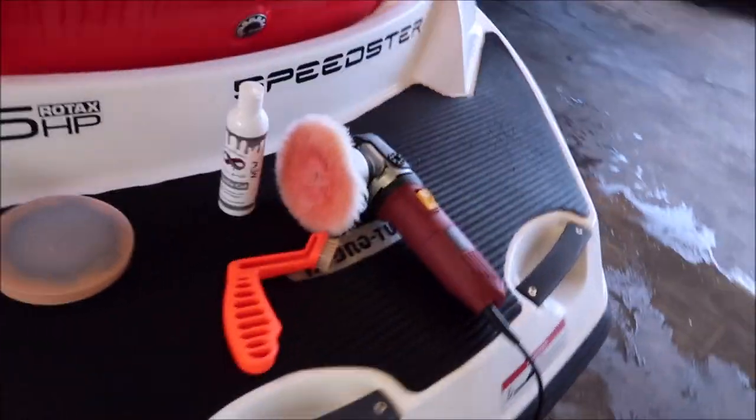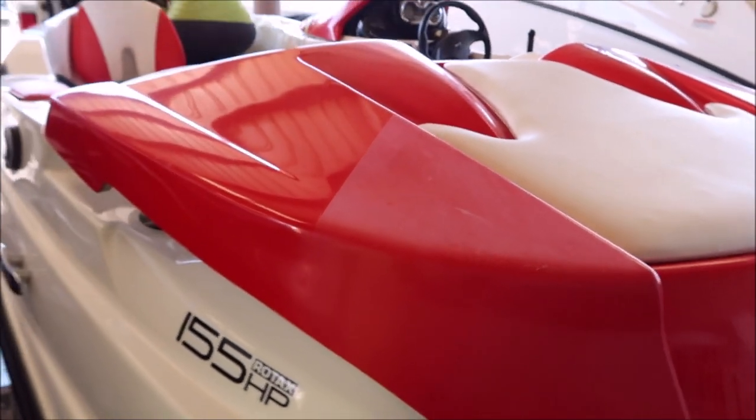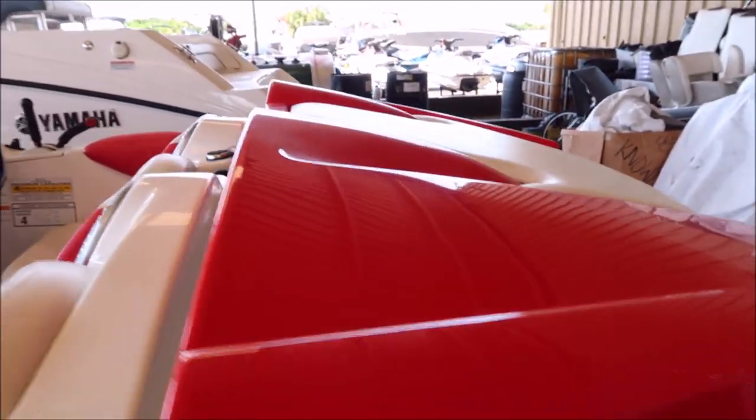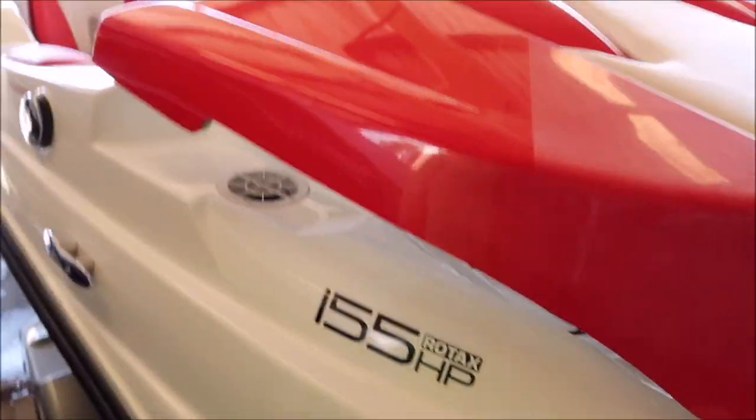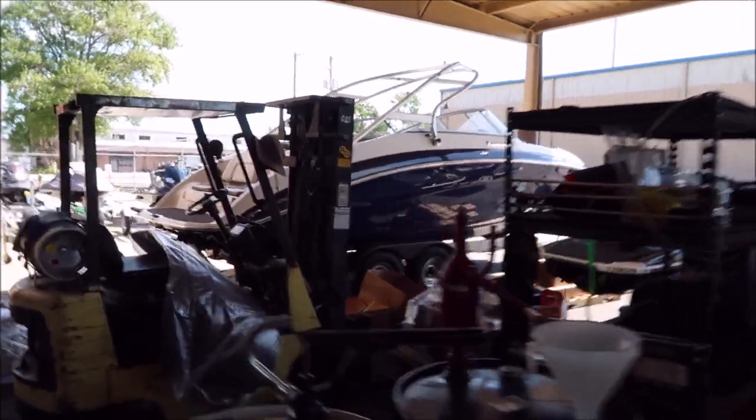Now to get the thorough wash done and this adhesive gone, then I'm going to start to polish. This Sea-Doo with its incredibly oxidized gel coat is a real pain, but look at that — not bad, huh? I tried Universal All-in-One from the One System as my first step. You always want to use the least aggressive method first. The Universal All-in-One is generally pretty good, but on heavy oxidation like this — and the boat we did the other day, that blue one over there — when the oxidation is that bad, you're really going to need to cut.